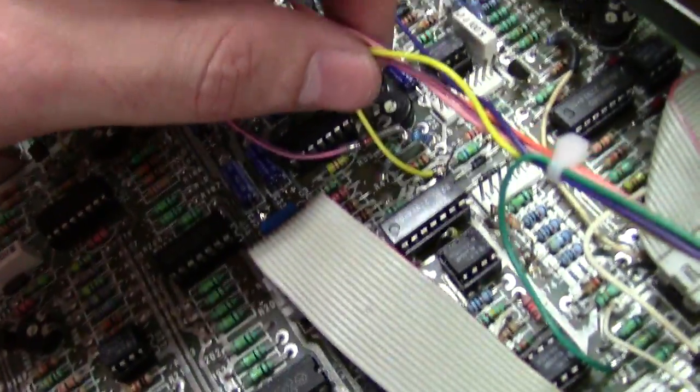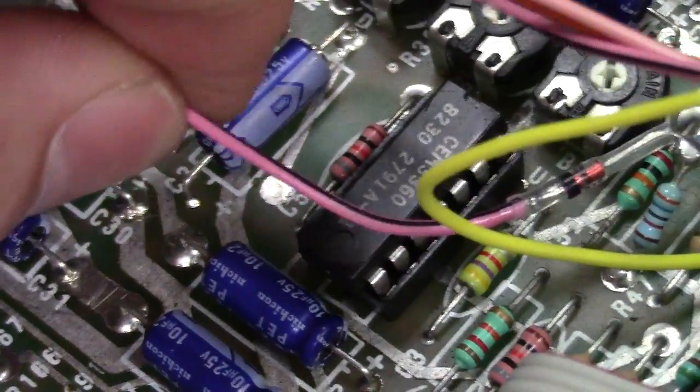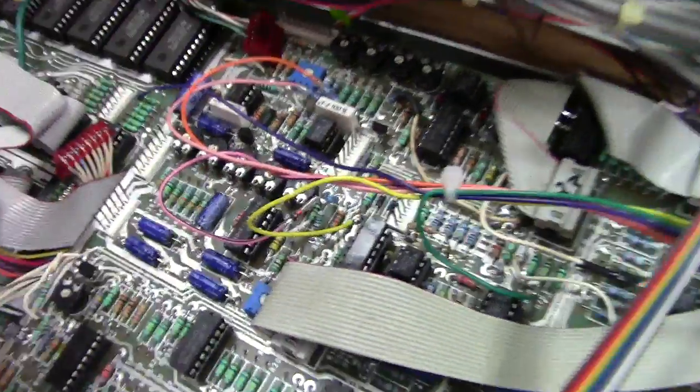It's the pink-black wire. Let me show you exactly what I'm trying to explain in this diagram. I made these two resistors stand up, as you can see. So there's your 3K, your Schottky diode, and then the other value resistor, which is 36K. There's your 36K below it. That's how I did that, so it's wired up like that. And of course you can see that yellow wire I was talking about earlier. But this is the pink-black wire. As you can see, it's got a black stripe on it, and that goes to the Schottky diode. So that's how that works. That's the connection, and those are the changes you have to make there.